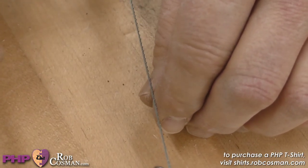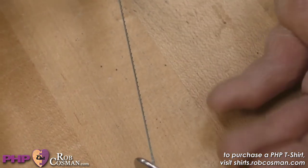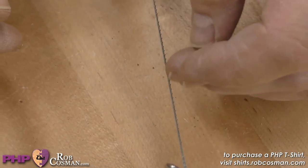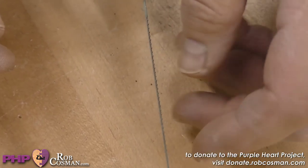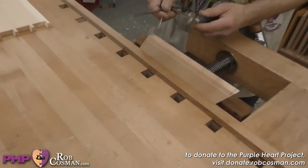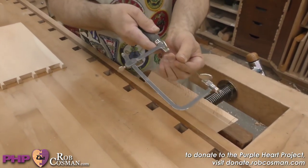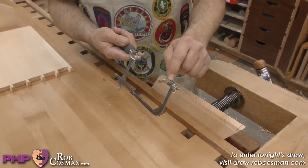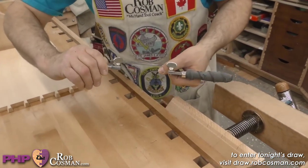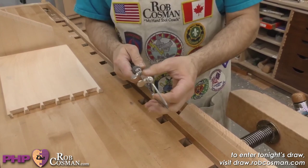And until it gets out of the wood, the sawdust builds up in that space. And if it builds up to the point where you can't put any more in there, it stops cutting. So a skip tooth is going to cut faster because you have more capacity for spent sawdust. The throat is only 3 inches, which means on something like this, you'd be limited. So what we do, after I put the blade in, and it's always designed to cut on the pull, so the teeth are grabbing as I pull it this way. Teeth are clamped top and bottom. You tighten up at the frame, and then you turn this wing nut, which I've broken on mine, and that gives that blade nice and tight.